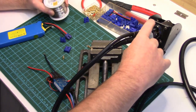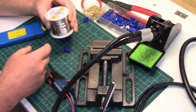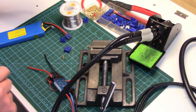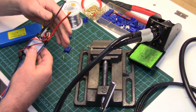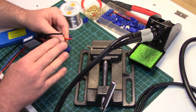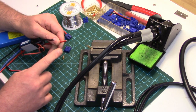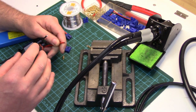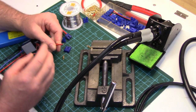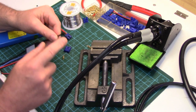We've filled the pin about halfway up and it's got a nice layer of rosin in it. This is 60/40 rosin core solder. Now here's our ESC — it doesn't really matter which pin you do first. The importance of having a good tinned wire end is critical here. You want the solder to have penetrated well into all the strands so you've got a good strong mechanical connection, not just an electrical connection.